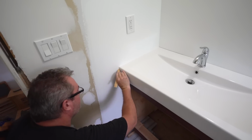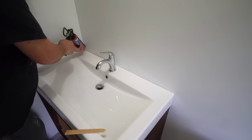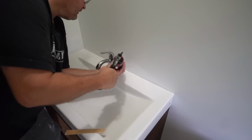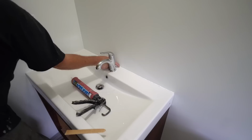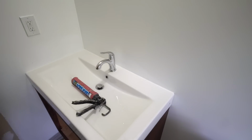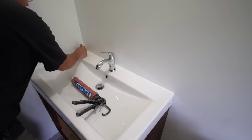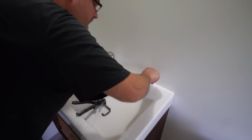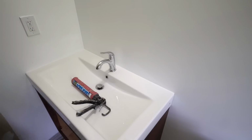So next time I'm going to be building the drawers that go in here and installing those. And the reason why this may seem like I'm all over the place here is because I was doing the tiles before, and then I jumped to this. The reason why I did this is because, first of all, I have to wait until my epoxy grout comes, which is not here yet. And second of all, I want to finish the tile base around this cabinet. It goes across the front and returns down the side as well. And that all has to be grouted to the floor when I do it. So I need the vanity in place to do that.